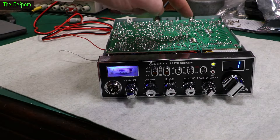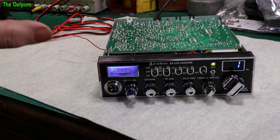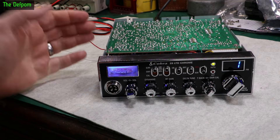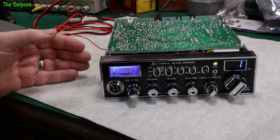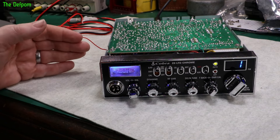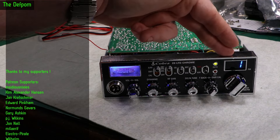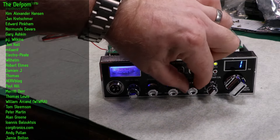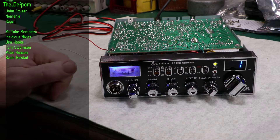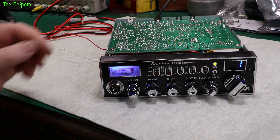What I need to do is probe the serial communication lines and try to capture the data to see if I can interrupt it and manipulate it. The data sheet does say what the packets and addresses are for each bit, but it doesn't actually tell you what a bit value of FF means. So I'm going to see what it does on transmit and receive on the same channel, and also observe delta tune, which I think may be linked as well.